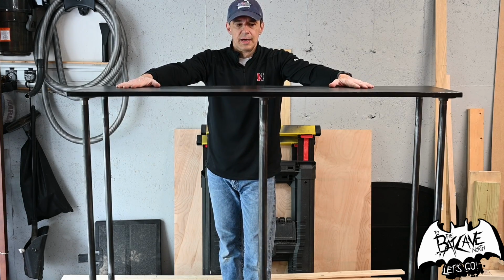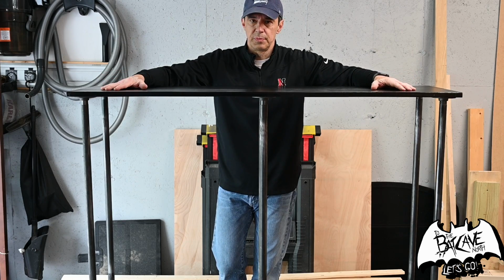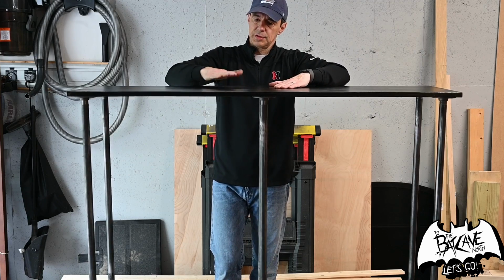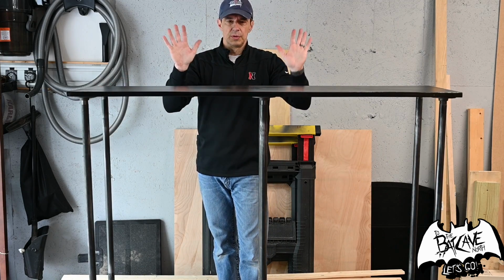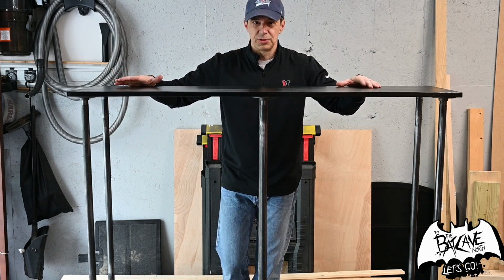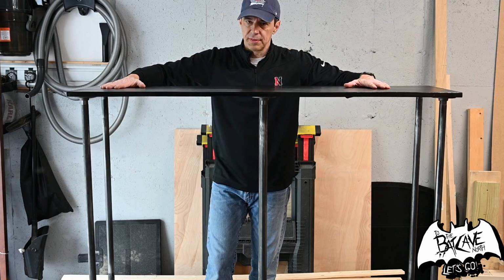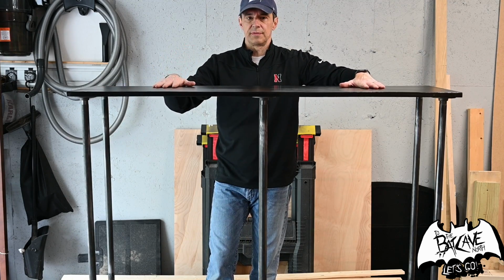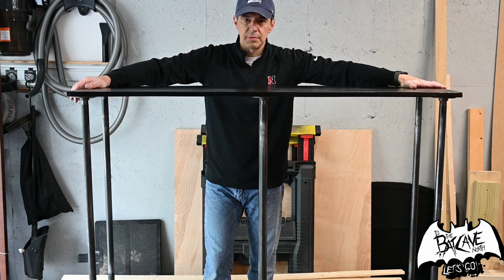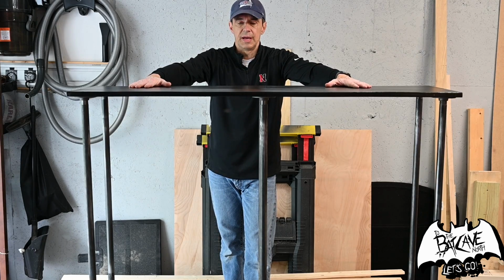One of the things that you have to do when you're putting a finish like this on is, because this is a 2-part finish, unlike paint, it takes a little bit longer to cure. So even though it's completely dry to the touch, it's probably not a great idea to put a 50, 60 pound statue or more on top of this right yet, because the urethane finish on top is still probably a little bit soft underneath and hasn't cured completely. So I'm probably going to give this several days upstairs to really cure well before I go ahead and put heavy statues on it.